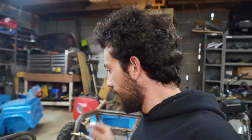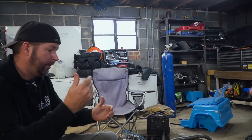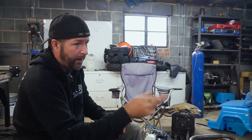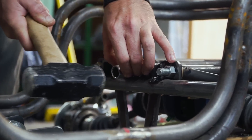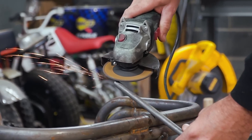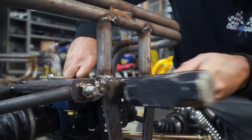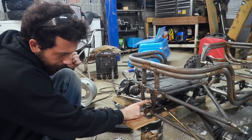We have one more brass bushing that we need to shave a little bit, then we can stick it in the other end, run our steering round stock through, and hook up the steering wheel. We'll weld up the tab, attach the steering rods, and we're going to need to weld in a metal dash — a crossbar — to help support the steering wheel. Our steering shaft is in place, and I have a nice piece of steel cut out where we can bolt our tie rods to.